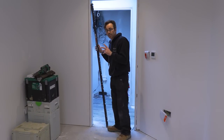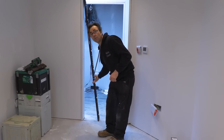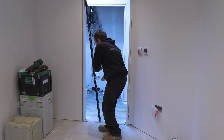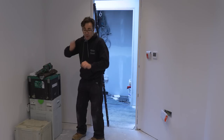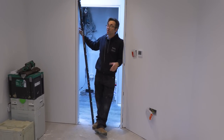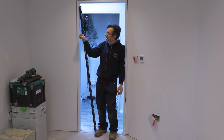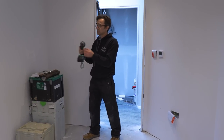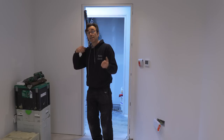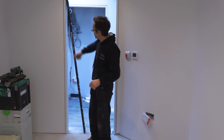When you use the skeleton hinge jig on the lining it's a slightly different beast — instead of being over the top you're more like this. A couple of words of advice: start with the bottom one and work your way up. If you do it the other way, by the time you get to the bottom all that dust has fallen through, you've got to get your vacuum out. So — bottom, middle, top. They also want you to bang the pins into the lining. If you've watched our video on MDF door linings you'll know I'm using MDF as opposed to softwood. If they're softwood you can literally push those braddles in — MDF has a denser edge so I like to put a very small pilot hole and then just tap the braddles in.